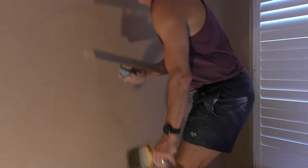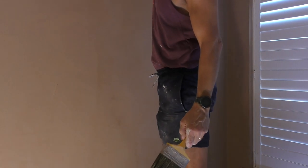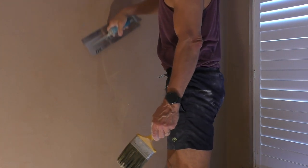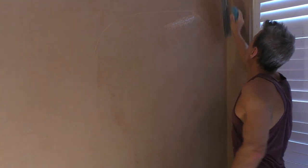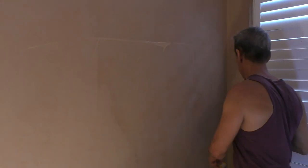Make sure any walls that you're not going to plaster are nice and clean. Now I think finally here I'm just giving it a spray and taking my flexi trowel over the top. The trowel I'm using there is my OX - most of the gear is easily identifiable by the blue handles. When I'm troweling up and spraying water on or splashing it on with a brush, I tend to work from the top and then work my way down to the bottom, rather than starting at the bottom - any water you put on there starts running down which isn't great. Get into your corner there and make sure you've got a nice neat angle.